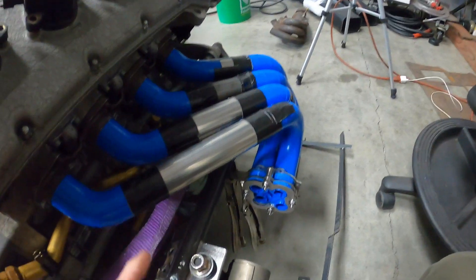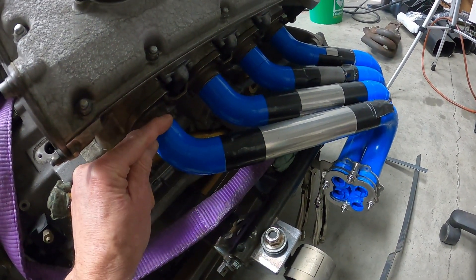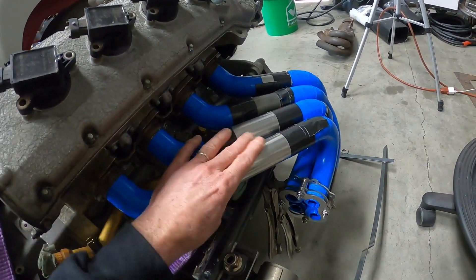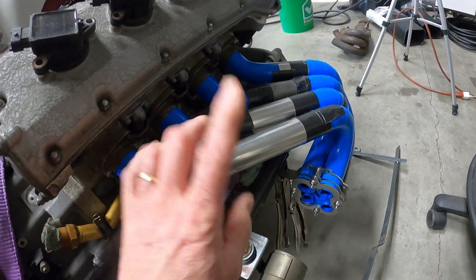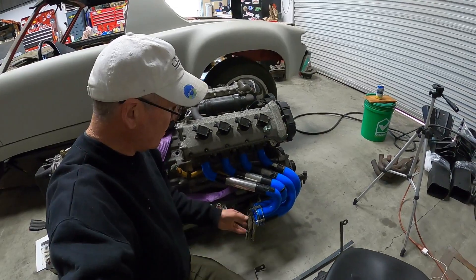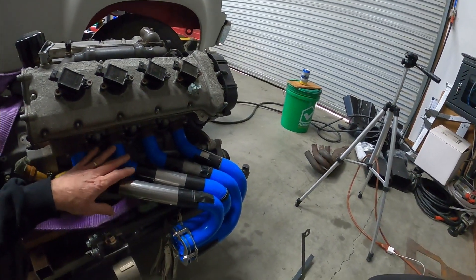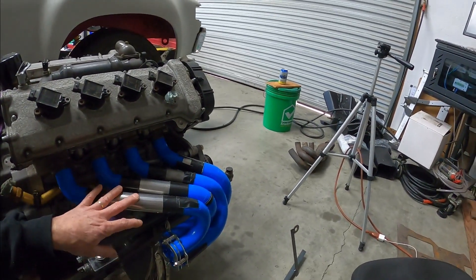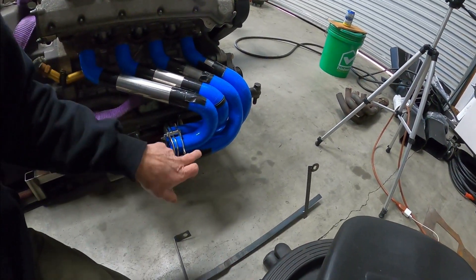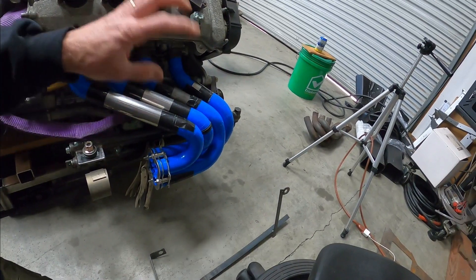What's driving particular positions is that each piece of the header modeling kit is a predefined percentage of whichever radius you're talking about. If I needed just a third less of a two-inch radius here and a third more there to clock a tube in a particular direction, I can't model it to that level in plastic — but I can do that in the real world. This has been invaluable as a design tool. This design is still equal length. One last thing about the Ice Engine Works kit — this looks like a complete hack job, and that's because I cheaped out and bought just a one-side kit. This particular design has some long sections of straight — like five inches here, six inches there, ten inches in another — so I used a ton of straight sections.